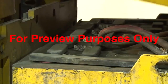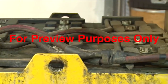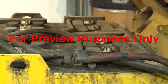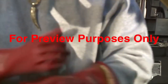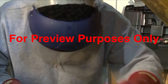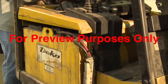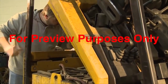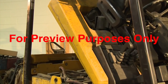As for electric forklifts, we've mentioned that recharging their batteries can generate flammable hydrogen gas. The fact that their batteries can generate sparks as well makes the process even more dangerous. To prevent sparks, keep tools and other metal objects away from the battery. Remember, this also includes jewelry and wristwatches. The charging process can also cause the batteries to heat up, so leave the battery compartment lid open to help cool them off. This will also allow any hydrogen gas to dissipate safely.